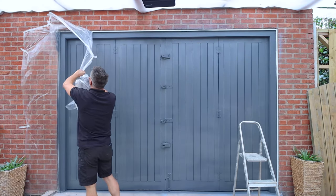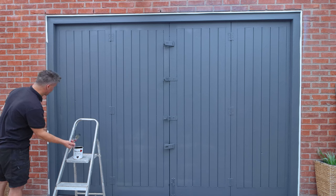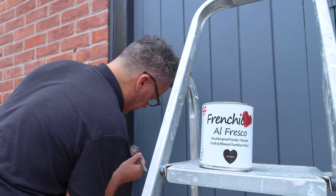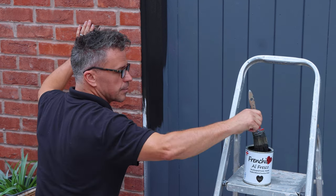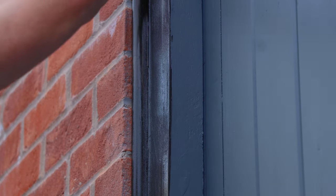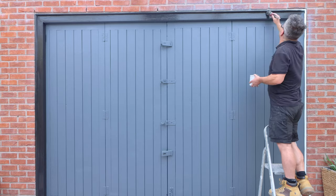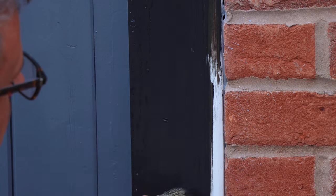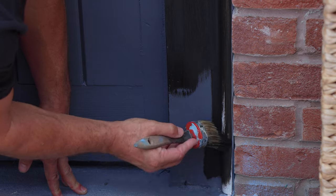It's almost dry — I've removed the masking tape, and now I'm going to cut in carefully using a paintbrush with Alfresco's Blackjack around the frame. I do use my paint sprayer a lot on large areas, but I find it quite therapeutic using French Chic paintbrushes on the detailed areas. It's nice, thick and creamy, and so easy to apply. Take your time when cutting in with a brush on the door frame. If you're not that confident, you can always mask along the edge of the brickwork while cutting in around the trims. In some occasions you may have to open the garage door a fraction to cut in on the edge of the frame. This wooden frame has had a plastic PVC trim glued to the side, but don't worry because the Alfresco paint will adhere to both materials.